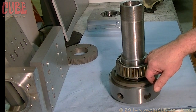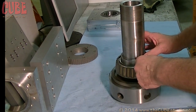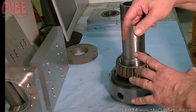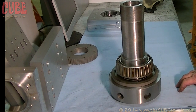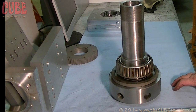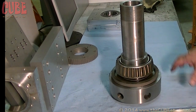That's important for precision bearings — if the shaft is not round, the inner race will not be round, so as the rollers come around they'll have tight spots and loose spots alternating. This is particularly critical with precision bearings like angular contact bearings and spindle bearings. Not terribly critical with this type of bearing, but still important if you want good long life, no buzzing, and no chatter marks on your work.